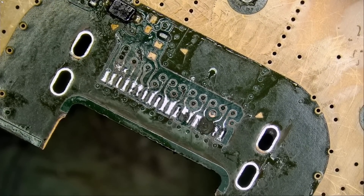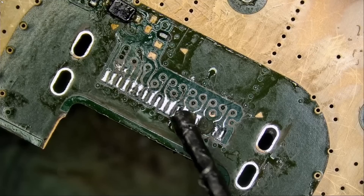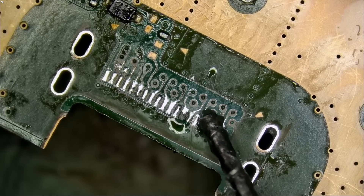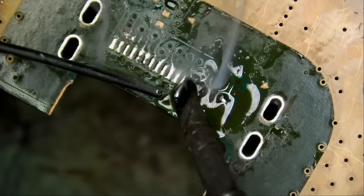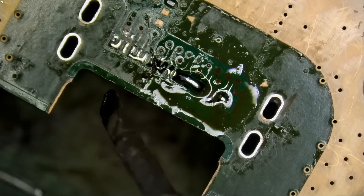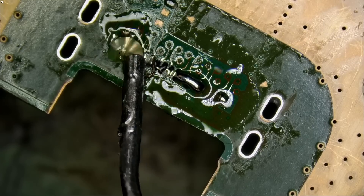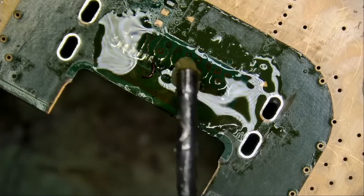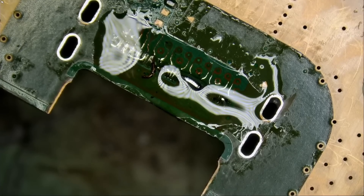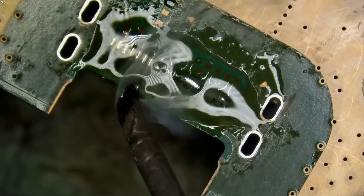That's how good this NF Sucker is. Now we need to run two wires. The third one — we have half a pad here, but that's okay, the HDMI pins will reach. You see what happens when we do not have enough flux? Because people always ask: what is flux, what is it used for, why do you always apply it, what's that gooey stuff? Flux is magic — you cannot solder without flux. Look at what happened when I applied flux.